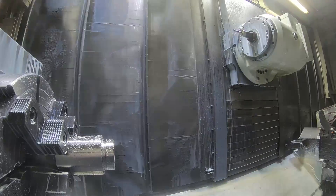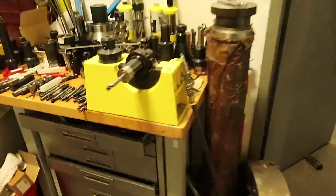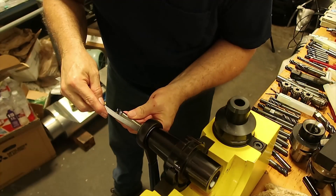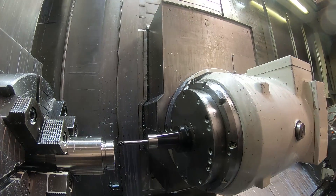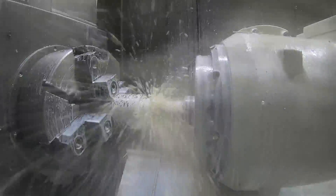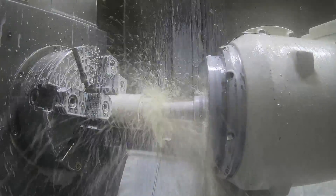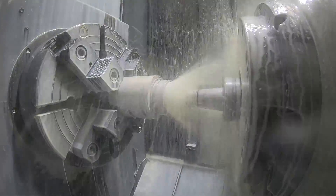You can see how close the collet chuck came to the part. Here's the first half inch roughing end mill — this is a short cut length with a reduced shank tool. I'm just putting a new one in there because it takes a new one for every part. This tool takes kind of a lot of abuse roughing that deep pocket in there — it's going almost 3 and 3/8 deep into the part. So this is just a roughing cycle, a trochoidal type of milling cycle on the face of the part. And then we come in with a 3/8 end mill — that's the extended length one — to rough out the end of the gun drill hole, which has some features that are going to be formed with a form tool later.